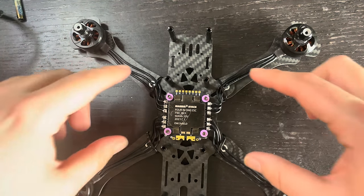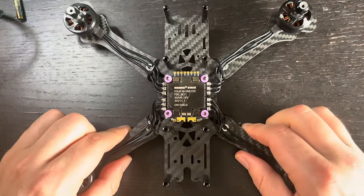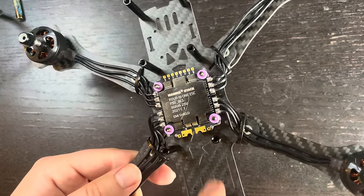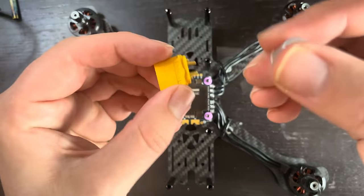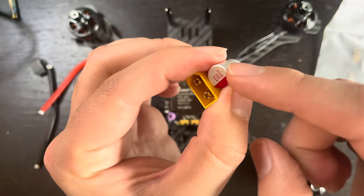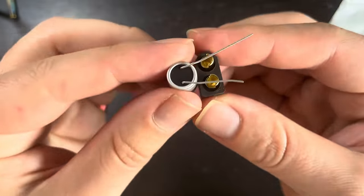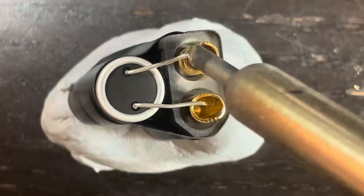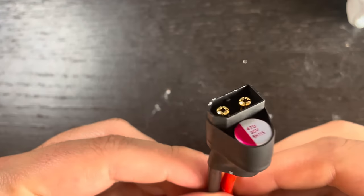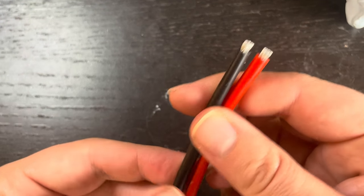Next, let's get this cable hooked up and then the XT60 power lead. I like to take the capacitor, cut it down so it sits flush with the XT60 pegs, solder it right on, and put some heat shrink around it. This frees up space on the board and keeps it cleaner. Now we won't have to worry about the capacitor taking up extra board space.